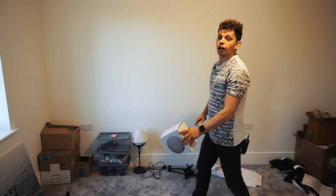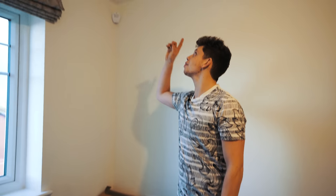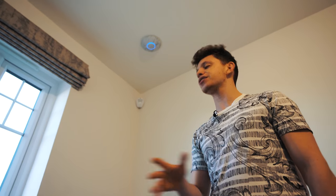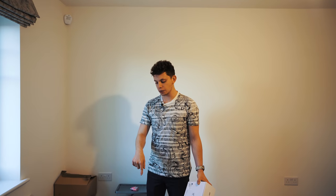Let's go upstairs. Right above my head is one of the Nano HD units from Ubiquiti Networks — one of their brand new access points. It's the baby version of the UAP AC HD, standing for High Density. These things can handle a lot of users and provide really fast speeds, up to 160 megahertz, which combines loads of channels into one single channel for the fastest speeds over the 5 gigahertz spectrum. I have this here because this is my office, and right below is the kitchen table where I work with my laptop.